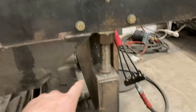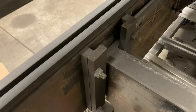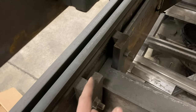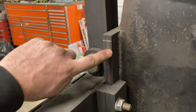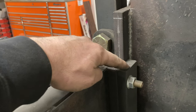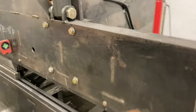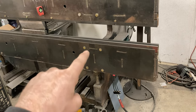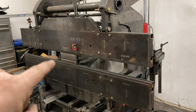So I can level the bottom die by these guys. It rides in this real simple track setup — there's a piece of three quarter inch flat bar and then these guys grip it. There's a thin shim in there to give it just a little bit of play so it moves easily. This flat bar is welded to the frame and then this little gripper channel is bolted to that. It's got about a four and a half inch stroke, and combined this has about three or four inches of movement as well, so I can play with the spread between the two jaws for different tooling.